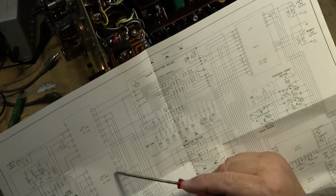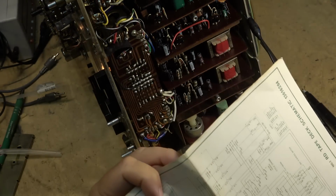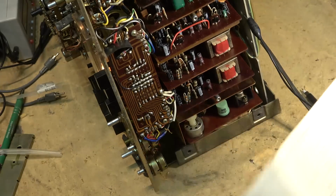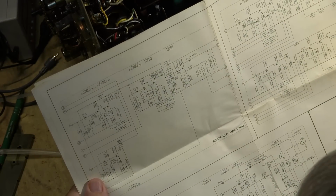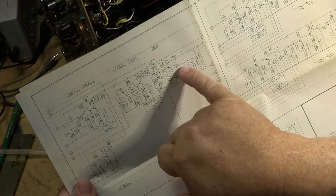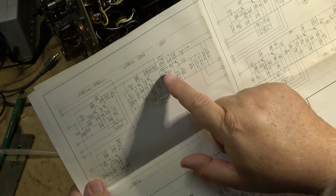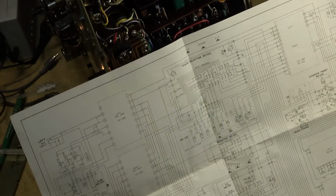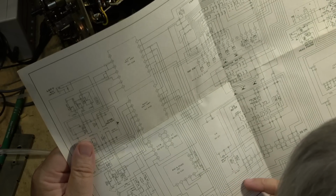We have signal on the board. Where do we check it? We check it at the record amp board. So here's our record amp, and we checked it right here. The output from the emitter goes through this coil, which is these coils here that I checked it at, and the signal then travels out from pin 3 and pin 4 of the record amp board, which is right here, where it travels down through.